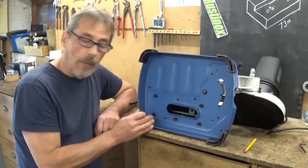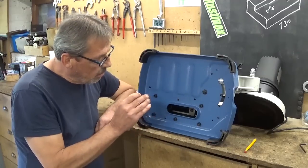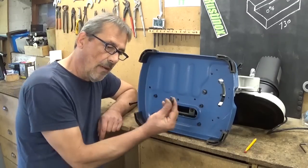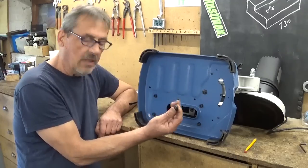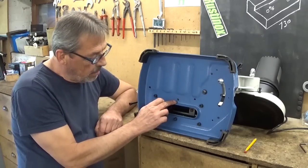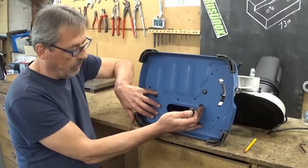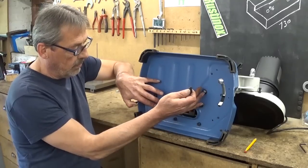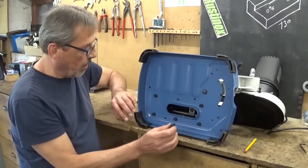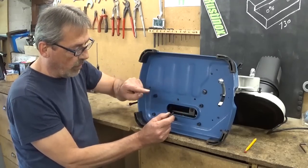Let's have a little look under the skirts of the machine. The vise is held on with 6 bolts. There's one I took out, it's 8 millimeter. To be good, this vise should move 10 millimeter up. And because of the thickness of the new jaws, I would like to move it 10 millimeter that way.